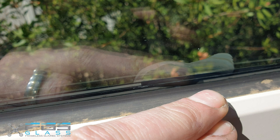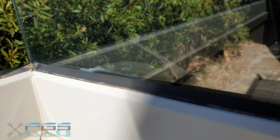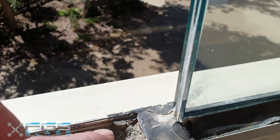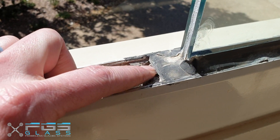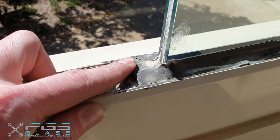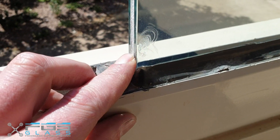The delamination is a direct effect of water sitting on the interlayer, so dry glazed channel is definitely the way to go. This wet glazed channel has allowed the water to absorb into the grout and get into the interlayer, starting a delamination process.